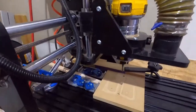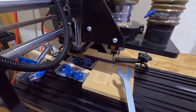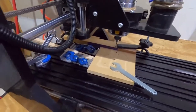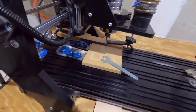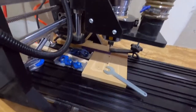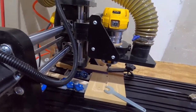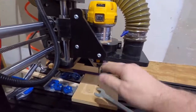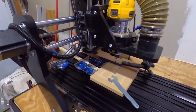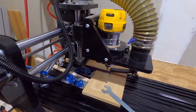We've gone through quite a few routers. We tried to keep them lubricated, but sometimes just running them takes a lot out of them. The other issue is that these are regular routers, so we have to manually change bits. Some of the grips we make are pretty complex, requiring several different cutting bits throughout making one pair. We have to stop the process, change bits, re-zero, figure out the starting points, then start the program back up — and that takes some time.